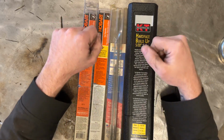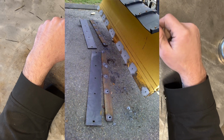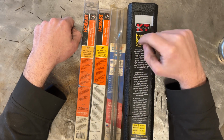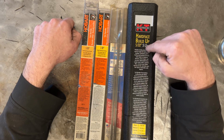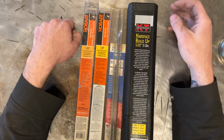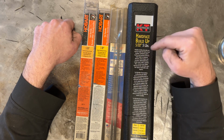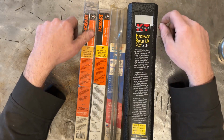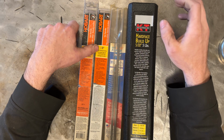So these would be great for building up if you have a plow blade edge that's wore down like, I don't know, 1/4 inch, 3/8 inch, or you got a gouge in it and you want to repair it. Using multiple passes with this guy is where it's at. Okay, it'll build it up and then it'll give you wear protection. The trade-off is that this rod in particular, the buildup rods, generally do not have anywhere near the wear resistance of a lot of the single pass only rods. So ultimately, these tend to only be maybe 1-2 times more wear resistant than the base steel, versus when you get in some of those single pass rods out there, they're so hard it's almost unbelievable and they'll wear forever. So it's kind of a trade-off.